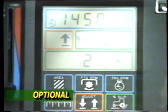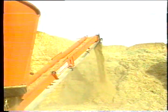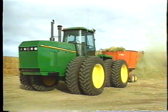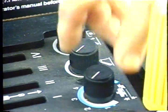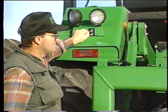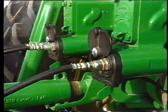The operator can also monitor engine RPM, true ground speed, area covered, distance traveled, and other important data including PTO RPM. A fully independent 1000 RPM PTO is an option that provides smooth hydraulic engagement and disengagement, controlled by a heavy-duty wet multi-disc clutch. Also available on the 250 to 350 horsepower tractors is a draft-sensitive three-point hitch option. User-friendly controls let you adjust sensitivity, raise height, and rate of drop quickly and easily. A special remote switch lets you raise and lower the hitch outside the cab for easier hookups. All four 70 Series Power Plus tractors feature three SCVs as standard equipment, with a fourth as an option.